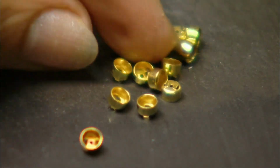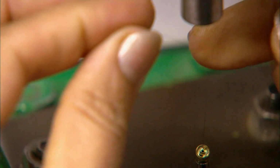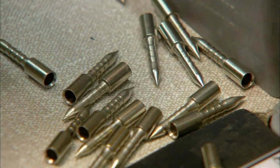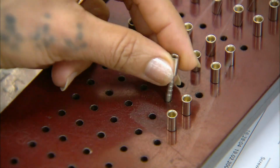They take a brass washer and wind ignition wire around it. They're assembling the striker pin, the device that indicates a blown fuse and shuts down the power. The striker pin is fitted to the washer, and with the wire protruding, it's placed into a holding device.